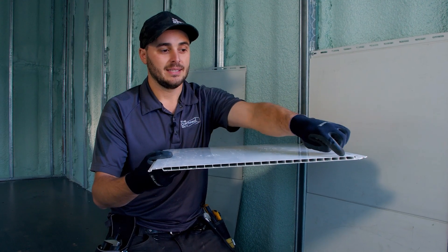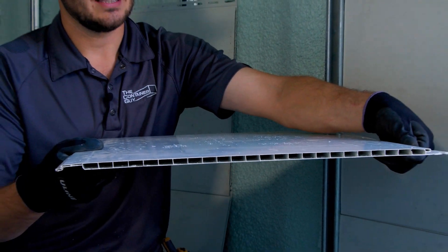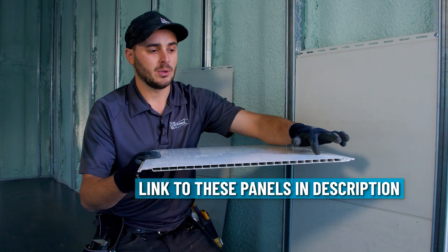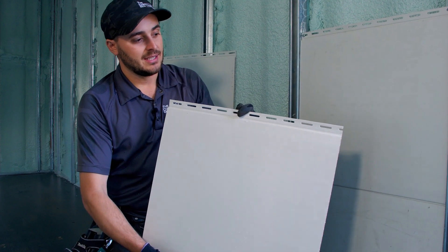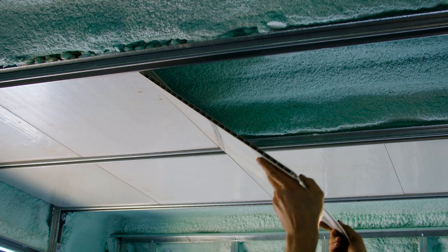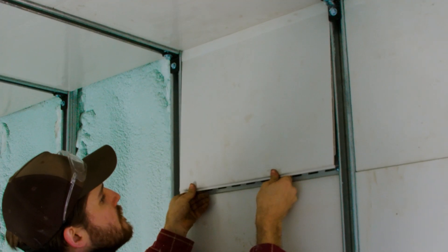To give you an idea of these panels — it's a hollow honeycomb structure about a quarter inch thick. It's a PVC panel, Class A fire rated, good for a two-hour fire-rated wall system when applied against a cement wall like a basement or car wash building. It has a nailing flange, and all we connect with are the two corner tabs left on our strut strapping. The J-channel installs to the strapping and then you just start sliding and interlocking each piece — like Lego.